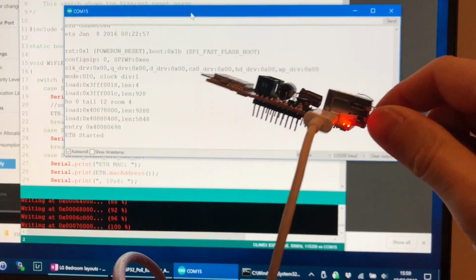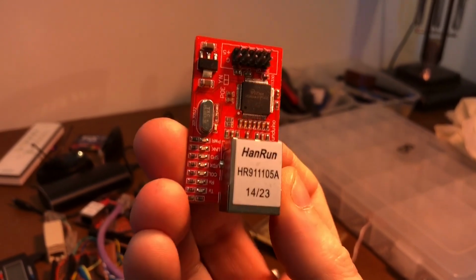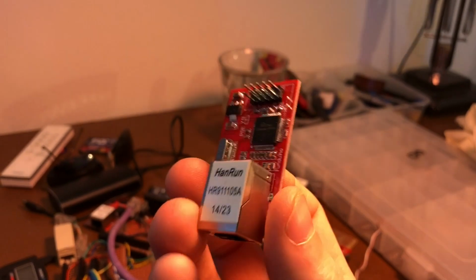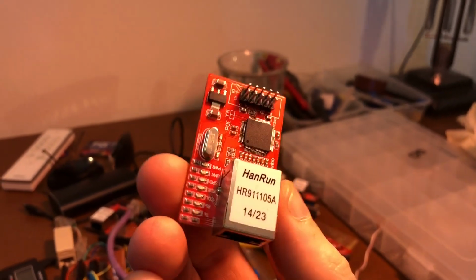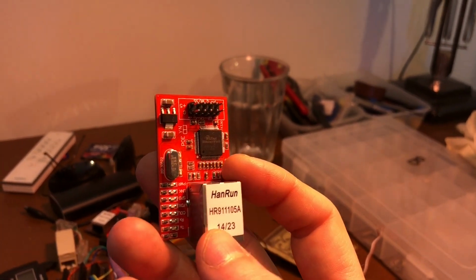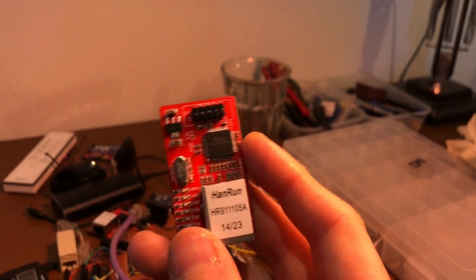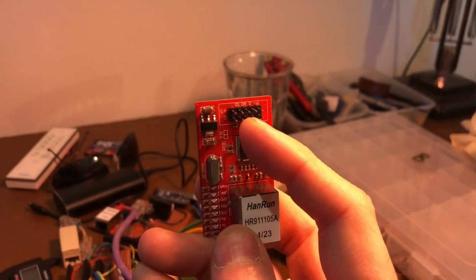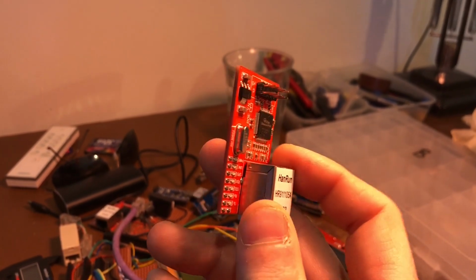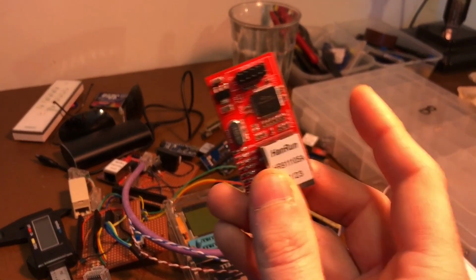I think, having messed around a lot with Arduino Nano and these W5100 breakout boards, they're called the Funduino board, there's a couple of little technical hardware bugs with it. There are some options to overcome them, but it's basically to do with the reset line not working properly. But you can overcome them by actually just tying reset high, and then I think resetting the Nano a couple of seconds after this gets power.